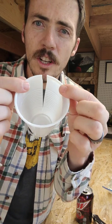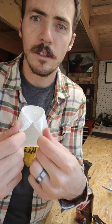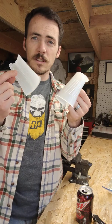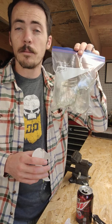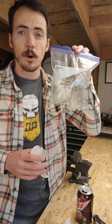Something about having an initial flaw makes it easy for that thing to break into two pieces. If we continue, this would probably continue all the way until we have two separate components — that's fracture. It was controllable; I could keep applying force and the flaw continued to progress. But that was not the case with the glass ceramic. Once the flaw started, it continued to propagate in a spontaneous manner — I didn't have to keep applying force. It just broke on its own.